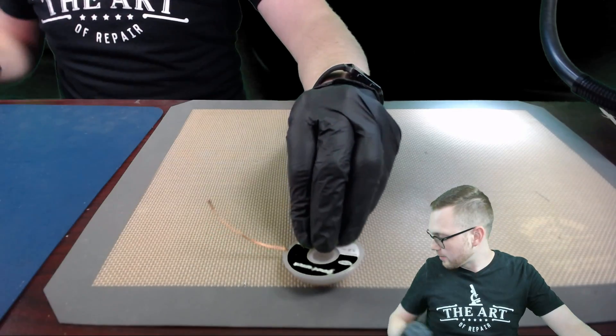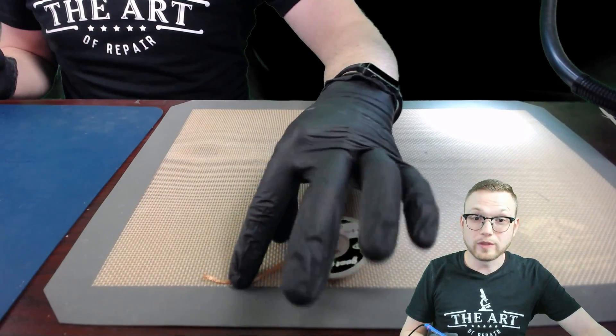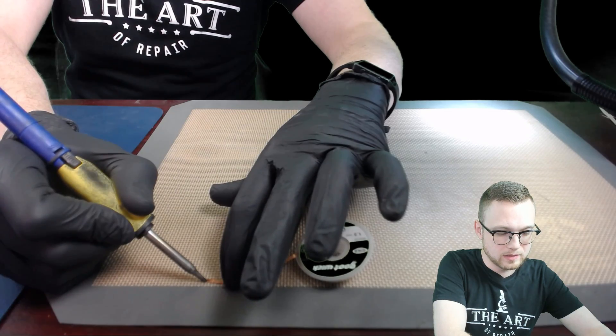The first heat sink is your wick. Let's do a little experiment to illustrate the point. We've got some wick right here, and I'm going to grab my soldering iron. I'm going to hold it here and heat this up. Point proven — all that heat is traveling through your entire roll of soldering wick, in effect wasting the energy and pulling it away from our target, which is the board. So to fix this, let's cut the wick short, decreasing its thermal mass while increasing the efficiency of its usage.